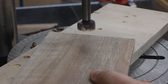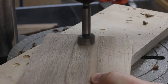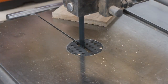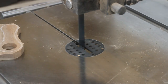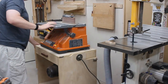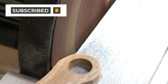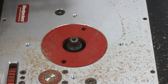Next up is the handle. I drill a one-inch hole at a seemingly arbitrary location on this thin flat piece. And it wasn't until I was sketching out the shape of the handle that I realized — yeah, that was a pretty dumb spot to put the hole, because now I'm going to be wasting a bunch of this wood. Good thing I didn't have to pay for it — I found it. It was stuck to the front of one of the drawers in my neighbor's kitchen. Just a little bit of prying and it popped right off. Next up, I could use the disk sander to grind it down to the line, followed by the belt sander to refine the shape. After that, I put a round-over on it back at the router table.